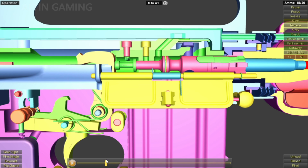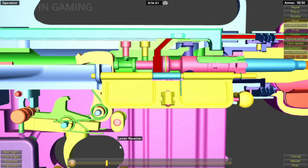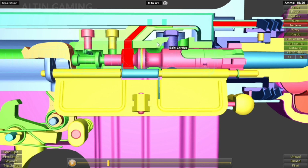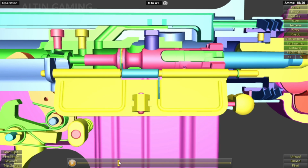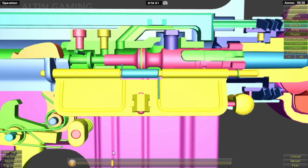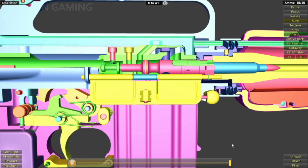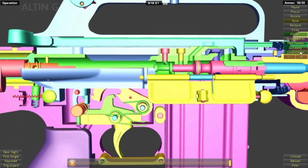So the gas pushes the bolt forward to keep it locked for a few seconds. The gas gets into this chamber and expands, pushing back the bolt carrier and pushing forward the bolt, so it stays locked until the pressure inside the barrel is lower, and then the bolt carrier will start tilting to unlock. So something like that, and then it goes back, and the casing is ejected. Okay, a single fire.